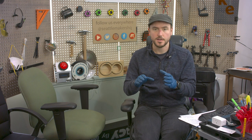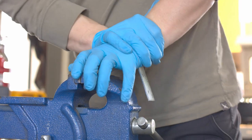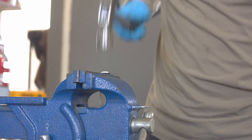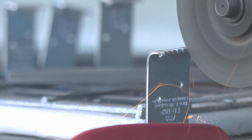Information on how to do that is on our website at seattlemakers.org to make hands-free door openers. You're going to need to take a standard Home Depot bracket and bend the corner — we just put it in a vise and hammered the top, lined it up with the first hole and hammered it forward. From there, you can grind out little grip holes; this isn't 100% necessary, but it does make it a lot easier for your shoe to grip. For these models, you're going to need to drill out larger holes into the bracket so that screws will fit in. We used number 10 screws, and we made sure that the screws were just short enough to not punch through the door.